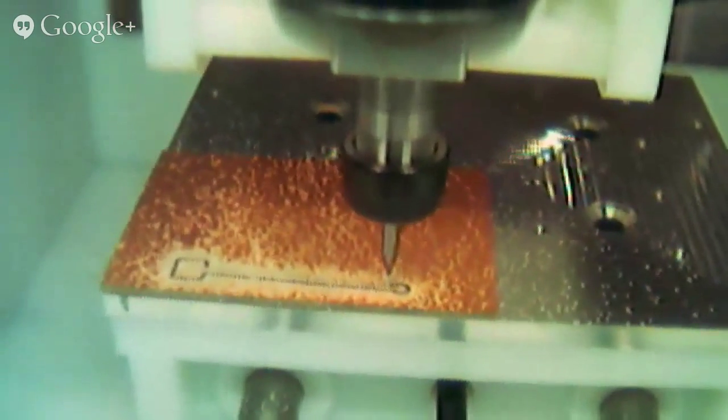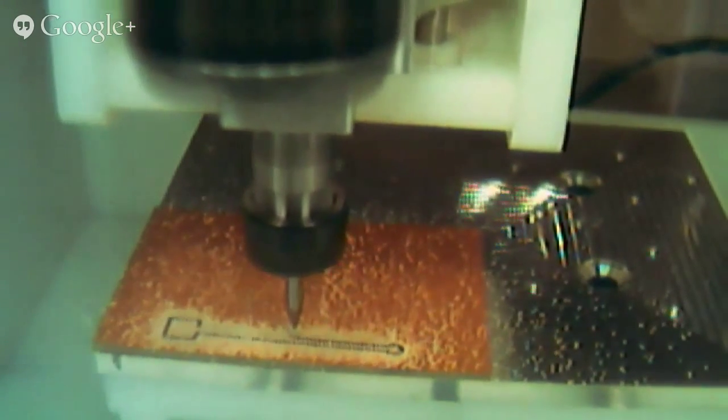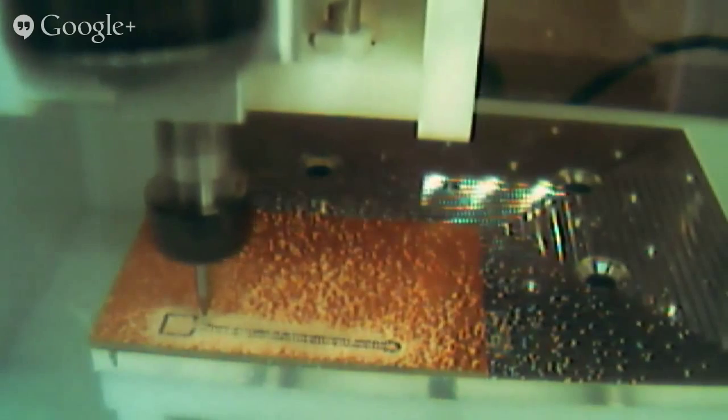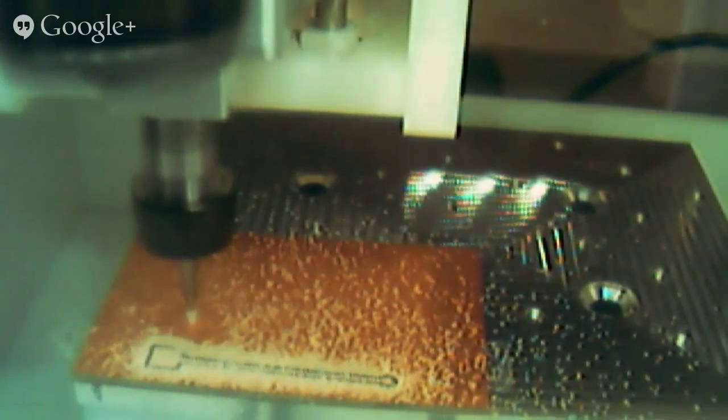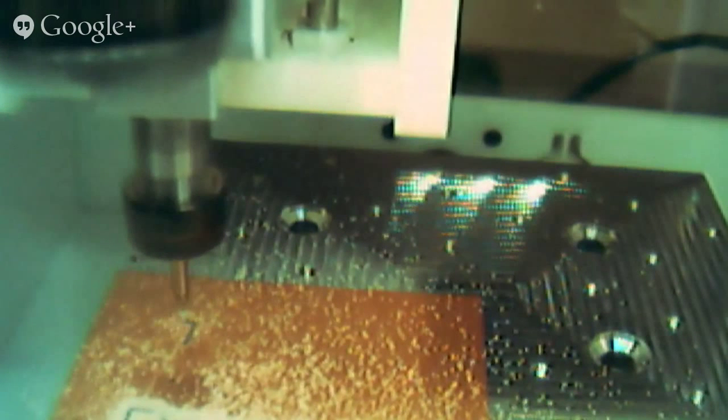Okay. And then do you have a way of making sure that you print the layers mirrored so it lines up correctly? Eventually, yes. Right now, this particular file is simple enough that you don't really have to worry about that, but there are ways to work around it on double-sided boards for now, and then we'll have full double-sided boards support. You have to generate a mirrored image of whatever you want on the opposite side of your board, and we actually have people doing that already, and it's working out pretty well. We've done it in a bunch of different software packages, and there are always things that need to be worked out. You can just mirror the board and have it work out.